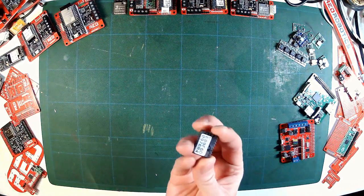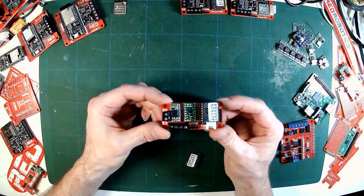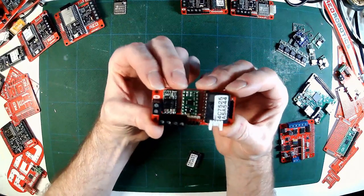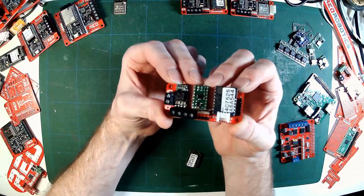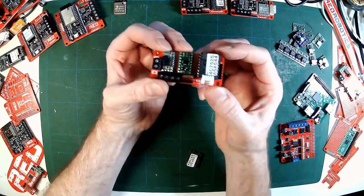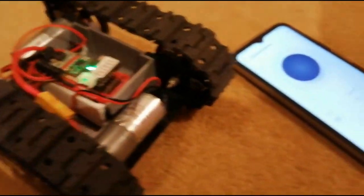When I first started thinking about the design of a board, I thought I'd keep it as small as possible — ideally the same size as the Raspberry Pi Zero. So I first chose to use an M5 Stamp Pico, a tiny ESP32-based microcontroller with just enough inputs and outputs to drive a couple of motors, control a few servos and read a few sensors. I started designing the board using KiCad, and here's the result. It's got everything I wanted: a DC-DC converter so you can use a range of batteries, a dual H-bridge for controlling two motors, reverse polarity protection, and four spare GPIO pins to connect to additional devices. I was pretty happy with this — I put it inside a chassis, had a quick test, and it worked.